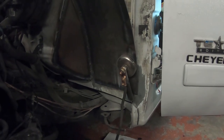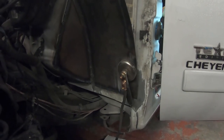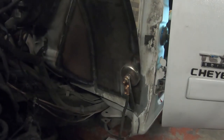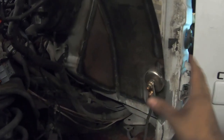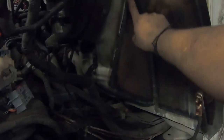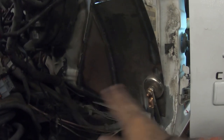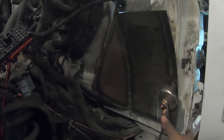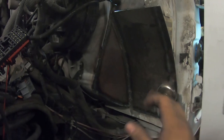One thing that I've learned over the years of experience is welding on sheet metal. I've learned how to do a full bead instead of just doing your normal tacks. I just feel like tacking it looks really funky and not as professional as this. I mean, I still gotta go over. I could leave it like this, but I like to smooth this out and then make it look a lot better. This right here too. And then do a primer coat. And then after that, undercoating so that it's rubberized and repels any kind of water or oils or whatever.